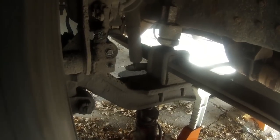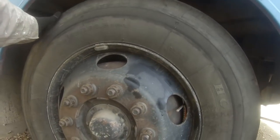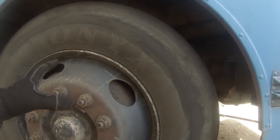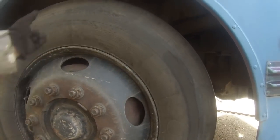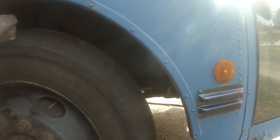So what he's doing: tighten all the way until the wheel is not turning, then back off about a half turn. That lets it spin freely, but see how it still kind of catches? Right about perfect — it's spinning freely but as I let go it stops slowly, not freewheeling like it was. That's about perfect. I should crawl under here and do that once a week, or at least every other week.